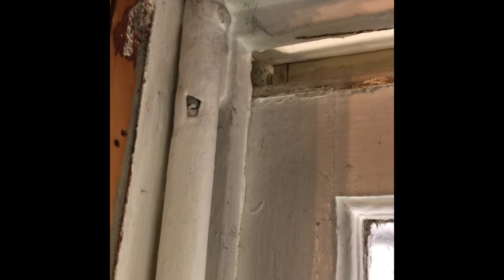This is why we try and do it in this order. All the stops are out now. This sash you can see is loose — it could easily come out, but we don't want to take it out yet. The best way to do this is to lift the sash all the way up as far as you can, because you've got to get a pry bar right in there and release this screw or nail, whatever they have in it. You're going to pry in this crease and release this from the window frame. It's under tension — inside is like a spring that helps with the weight of the window when it lifts. That thing will snap out at you and catch you in the eye, so definitely want to follow this procedure. I believe it's something I came up with — it makes it a lot easier.